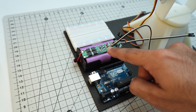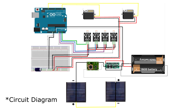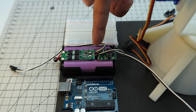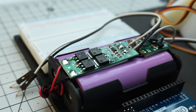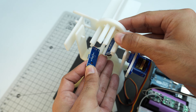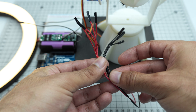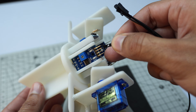I've already connected the BMS and TP5100 module to the battery. I've shared the full circuit diagram so you can check your connections. These wires connect to the solar panels — the 12-volt output from the panels goes into the TP5100 module, which converts it to 8.4 volts, which is then sent to the BMS. The BMS protects the battery from overcharging, over-discharging, short circuits, overheating, and more. I also made a custom jumper wire using four female and one male connector to create a common connection for the positive and negative terminals of all LDRs.